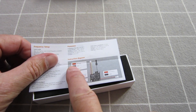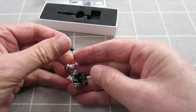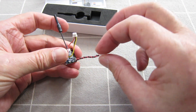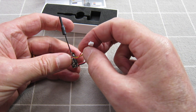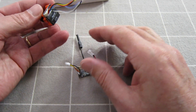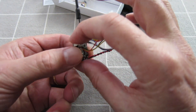Now that's interesting — that's not enough to run the Micro Swift 2 camera. These two are designed to go together. It's a tiny little transmitter, minimal, and we have power in from a 1S battery or from your receiver even. Video in and power out, but we can't use that power out to run the Micro Swift 2. They even provide some little bolts and standoffs and things to achieve that, so they are meant to fit together.